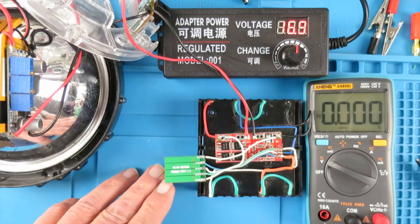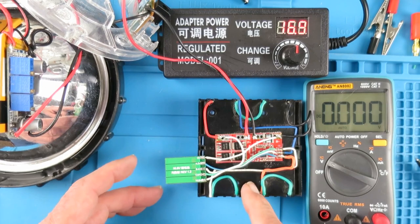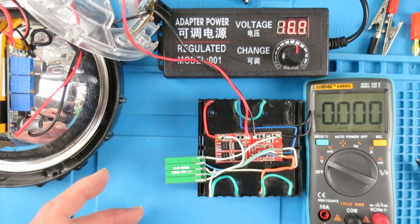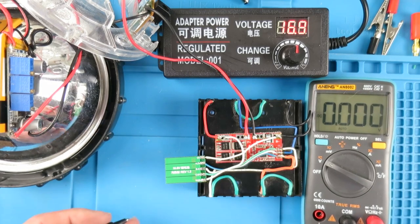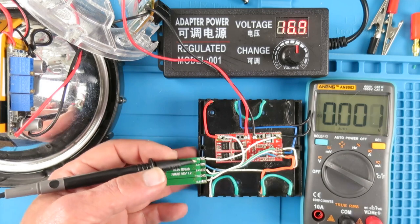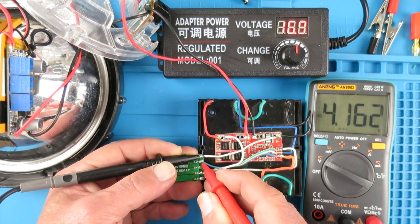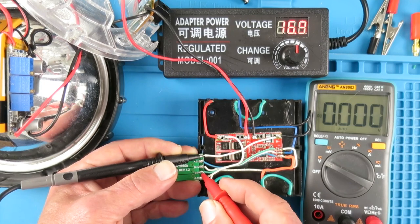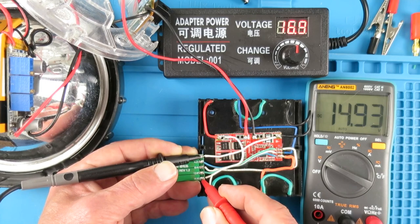I'm going to get this balance board soldered on. I carefully soldered the balance board on, and as a precaution — if you're going to do this, remove the cells first. These connections are very tight and one slip of the soldering iron and the magic smoke would come out, so take care. Now not under load or charge, we'll just probe on the board. So we can see our first cell — that's the charged one — moving up to 8.15V for the first two cells combined, and the last cell gives us 14.9V total, confirming they are most definitely still out of balance.